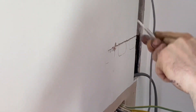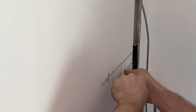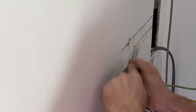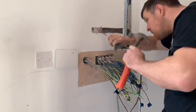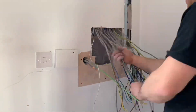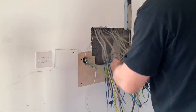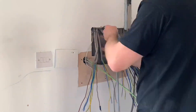We're lucky here — this is a dot-and-dab wall, so Ross is just removing some of the plasterboard for the new position. He's marked the wall with the new positions and he's going to bring the cables in. This means we're probably going to have to replace the metering tails at some point as well. Out comes the fabric of the building, and now we're just going to move them up and see how much length we've gained in order to fit the EZ9. A much better approach than having to join those cables — you'd be ripping that floor up again upstairs.